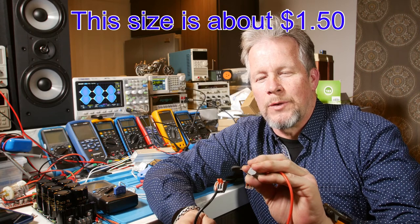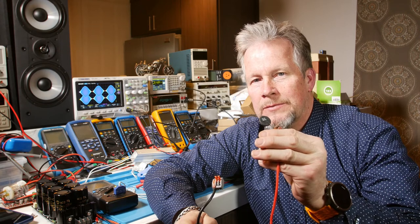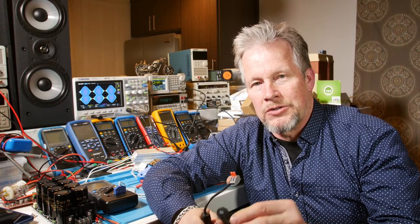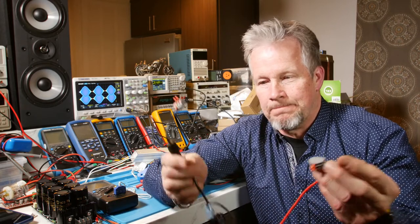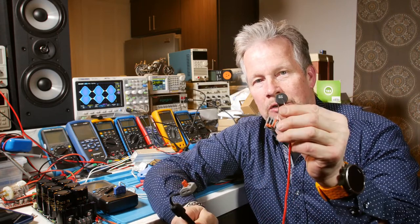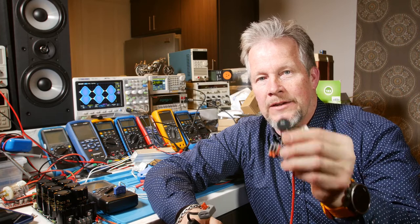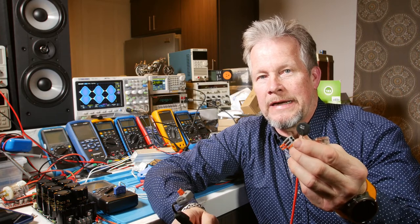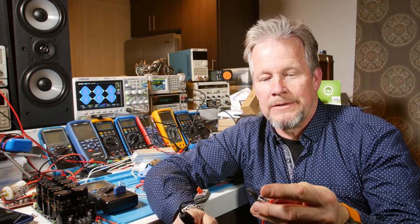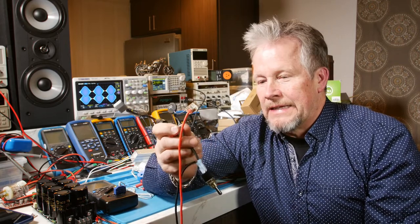This one is a 22mm SL22, and it's a 10 ohm. So it starts off at 10 ohms at room temperature, then heats up to some small fraction of ohms. Between the fuse and the thermistor, you throw the switch and you're limiting your current. At 10 ohms and 120 volts, you get 12 amps inrush current — then it heats up fairly quickly within seconds, and the current flows.